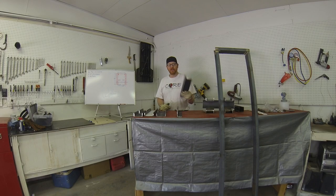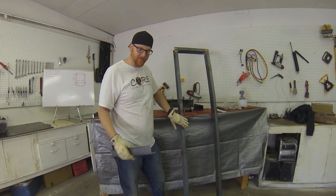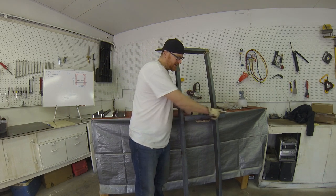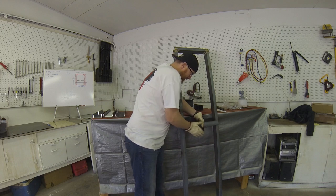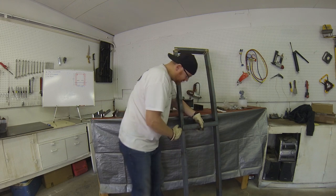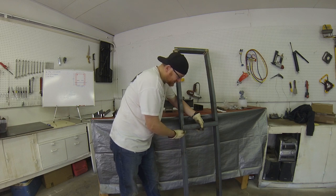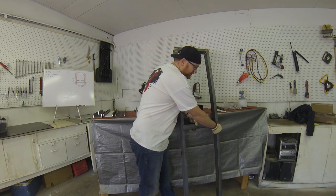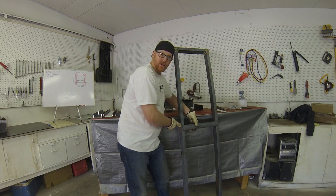Let's show you how this is going to mount up in here. This will be the bottom side of the frame and these are the parts that keep it in. We're going to put this exactly in the middle on this edge since we have two halves — it's a good tight fit. The force will be carrying on the bottom side with this nice lip for added security. We filleted this whole edge and left a gap here so we'd have good thick metal to weld on — if you weld on the very tips you'll often blow the tip out, so we kept it right in the center for solid welding.